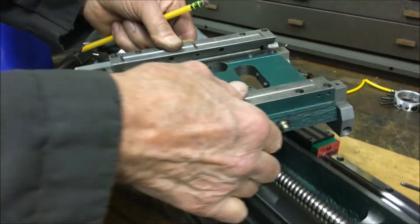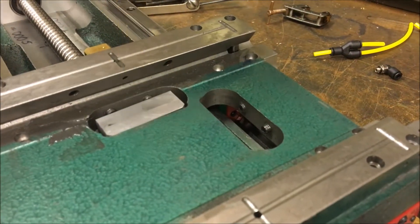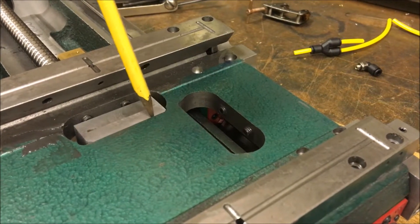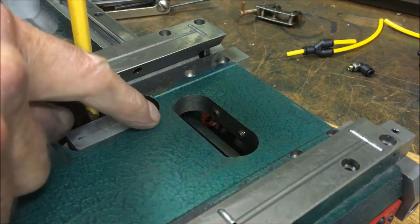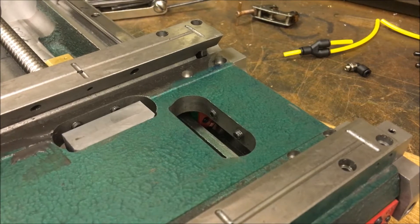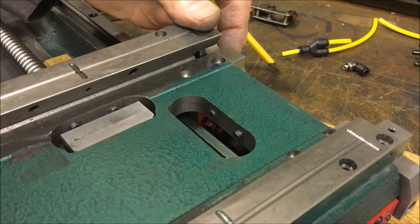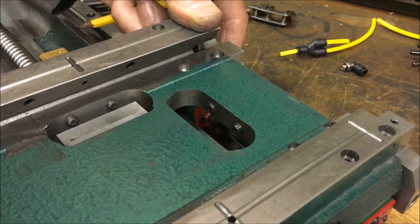So here you'll see what's going on. This is now all of the contact area from the ball nut retainer — we now have total contact across here. As we push this retainer nut in and secure it to the saddle, it's contacting completely across here. Opposed to basically — if you could imagine you're falling off a cliff and you're trying to hang on with your fingernails, that's sort of how it was before with the ball nut. Just the corner of the nut was bearing on that saddle. As the saddle raises up, you can see what happens — the contact area disappears.